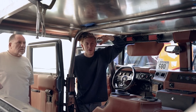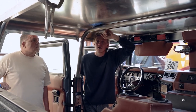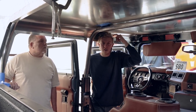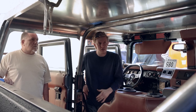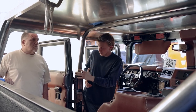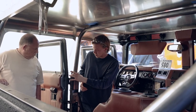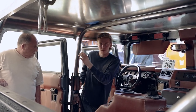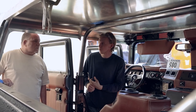Now we can talk about the B pillar. As you can see, it's fitting in the truck nicely so far — again, this is just the test piece, we don't have the final piece in the truck yet. Along the roof line it's fitting really well. We've got three-eighths inch spacers up here. We're going to keep the B and C pillars and the connecting pieces spaced away a little bit to allow for sound deadener, a headliner, and a potential leather wrap if you ever decide to go that direction. It does fit right back into the factory locations down here — it'll maintain the same bolts and the same door catch for the front two doors.